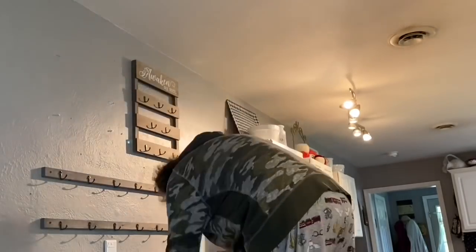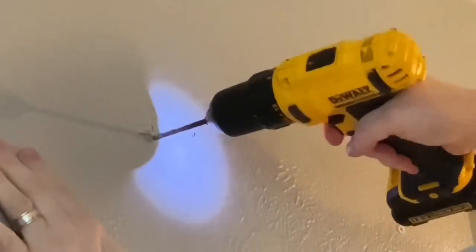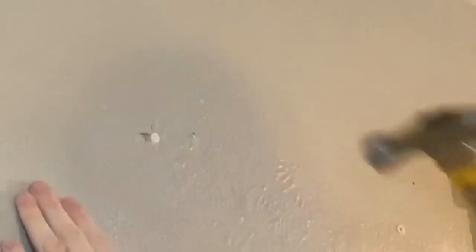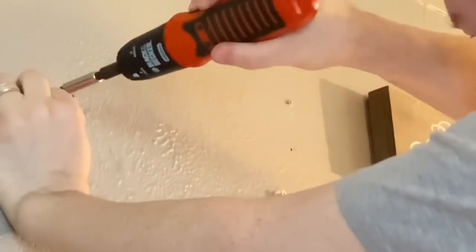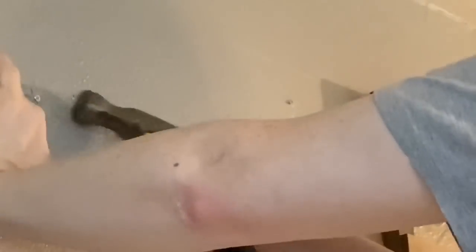People have asked me about this level — it's a Black & Decker Bullseye laser level. It's not cheap; I actually got it from my father for Christmas one year, quite a while back, and I really do love it. When you find out where your holes are going to be, take your stud finder and make sure there's no stud behind there before you drill for your mollies. This shelf kit came with mollies and screws, which were perfect for it, and it came with instructions. Jimmy likes to use this little Black & Decker electric screwdriver because it doesn't have as much torque as the big screw gun and he doesn't fear over-screwing.